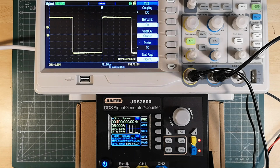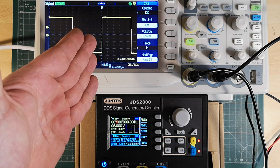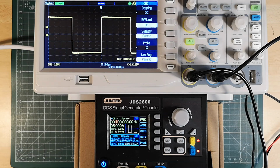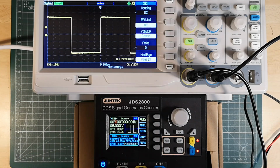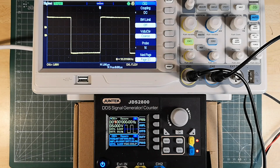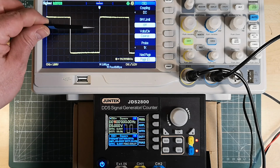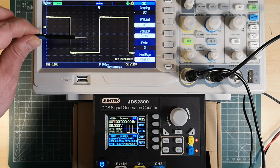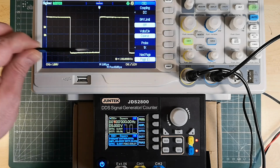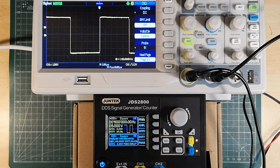So welcome to the third part of it. I'm just playing around a little bit and you can see some basics or some complicated parts, or why a square wave is not the easiest waveform. Not for the oscilloscope and not for the generator. A sine wave, even if it looks more difficult to draw, is easier, because on a square wave you're getting from minus, or from 0, to plus, and this should happen in no time. No time never works.